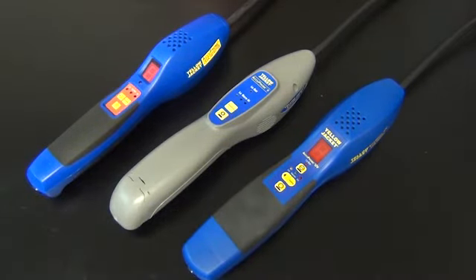So if any of these situations happen: remove the sensor, check the orientation of the pins, push the sensor on completely, and try again. If you still get any of these symptoms, try replacing the sensor. Thank you for watching this Yellow Jacket technical tip video. If there are any other tech tip videos you would like to see, post them on the ideas page at www.yellowjacketuniversity.com. See you next time!